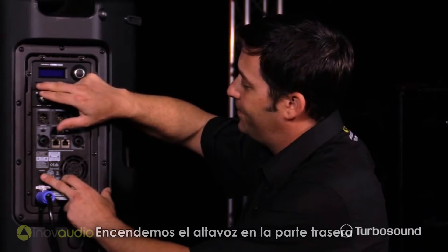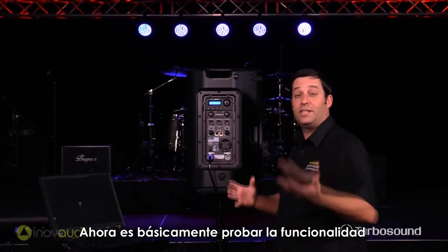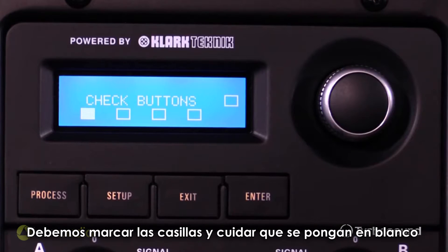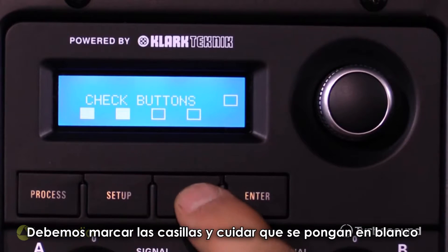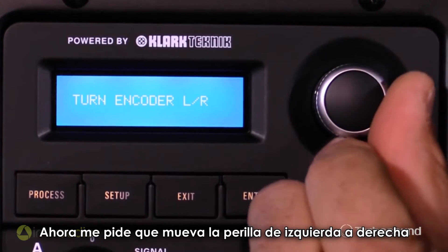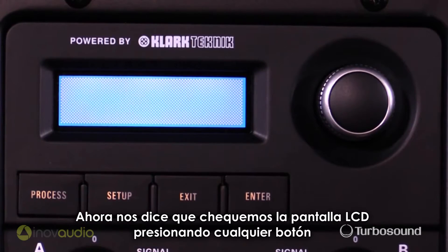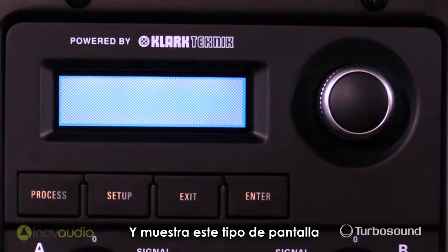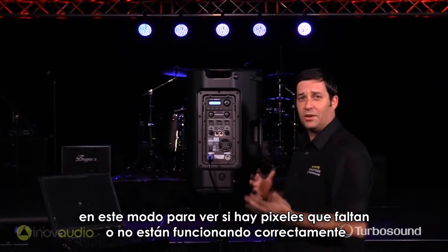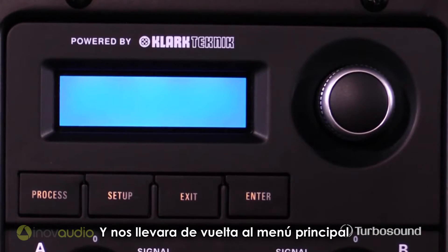Now I'm going to turn the speaker back on. And there we have it — it says 'check buttons.' This is going to basically check the functionality of all the buttons on the DSP module. Just check the boxes and make sure that the boxes turn white as you're pressing them in. Looks like they're good to go. Now it's asking me to turn the encoder left and right — the encoder checks out. Now it says 'check LCD screen' — press any button and it displays this type of screen, so you can actually look at the LCD screen and see if there are any pixels missing or not working properly. We just go ahead and hit a couple more buttons and now it takes us back to our main menu.